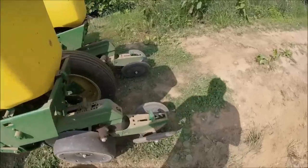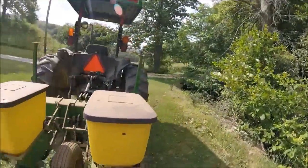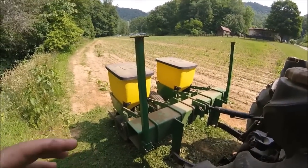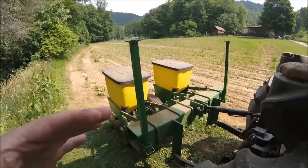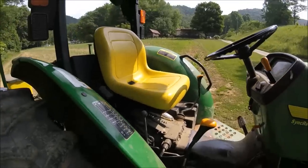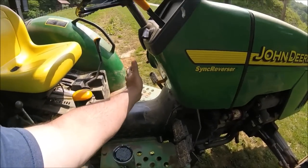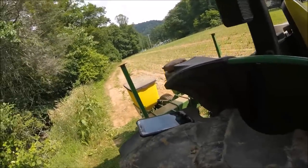The covering wheels are not going to be running properly when the unit is pitched down like that. I've got these in a float position so I could put a little pressure on them, but it still won't work properly. I need to make an adjustment on my top link. Also — never start a tractor from the ground standing beside it, and if you ever have to reach over to start it, don't stand in front of the wheel.